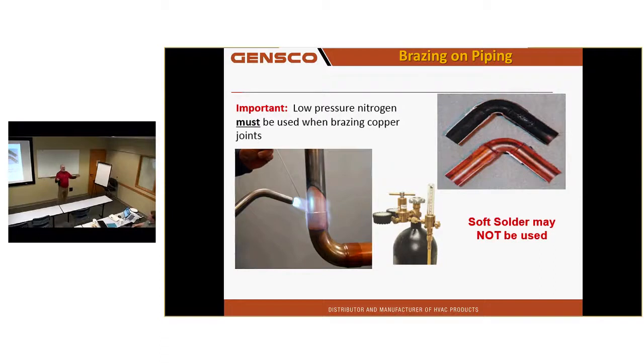Our big wall mount units, and I say big, anything over like 12,000 BTUs on City Multi-S, has 2 gas pipe temp sensors because that coil is split into 2 coils on that wall head. So there's 1 liquid pipe sensor, or saturation depending on mode, right after the LEV, but then there's 2 on the exit of the gas piping. Hot gas in heating, or suction gas in cooling. There's a company that has a server room for Amazon down here by Lake Union, and 2 server rooms, each with 4 indoor wall hung units. 3 on one system work fine, the last one does not work. And on the other system, 1 unit works fine, the other 3 do not work.